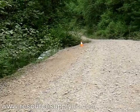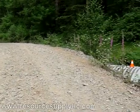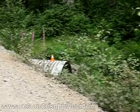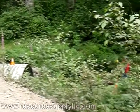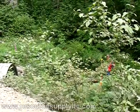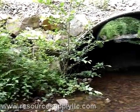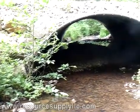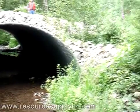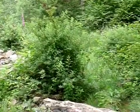This is the top of the fill. We're just basically looking at it, panning from left to right. You can see as we get over to the right there's a big culvert there. This is actually down by the creek looking at the culvert — it's a good-sized culvert. It'd be real easy to actually calculate the amount of material that is not in the fill just by looking at that culvert. You can just do a diameter and length on it and calculate that.